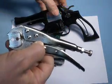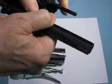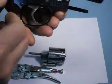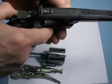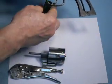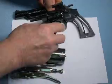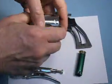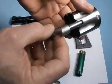To use the tool, remove the cylinder from the frame of the gun. On Smith and Wesson and Taurus models, you take this screw out right here, slide the extractor — the crane housing — out of the gun. It'll end up looking like this right here. This is called the crane, for those of you who are not familiar with it.